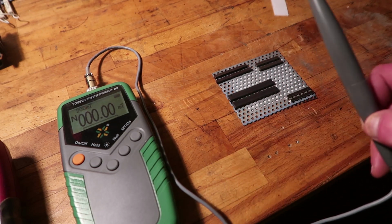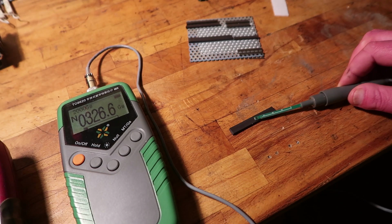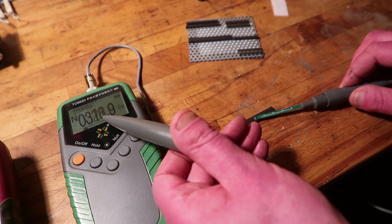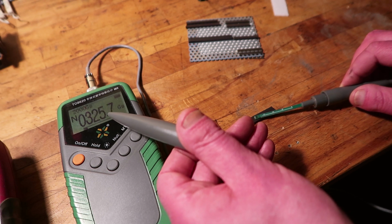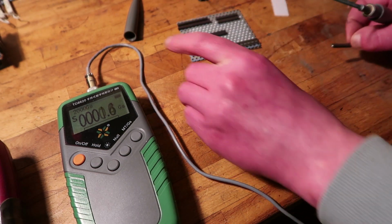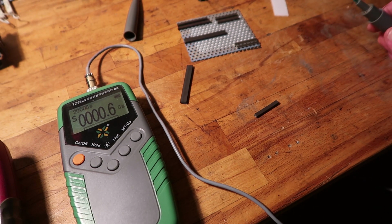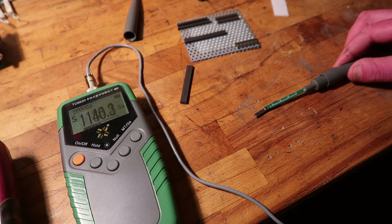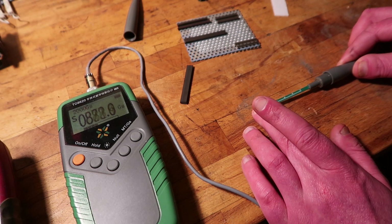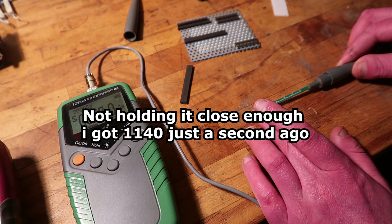So when I got it, first thing I did, of course, is measure them. Yeah, so I said to them, my current magnet has a surface Gauss of around 300 Gauss. Maybe a tiny bit more, 330. And they said, well, then you can use this stuff, and if we can magnetize it the way you want, you will end up with something in the region of 1300 or something. I said, if it was like 1400 or 1300, I would be really pleased. And it is, well, slightly less.